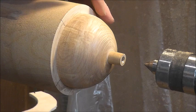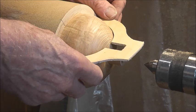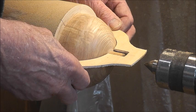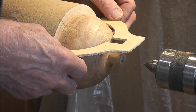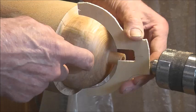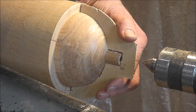I've taken it down by eye into a relatively nice curve, and I've got my template here. By putting these legs against here I can see I have to use my parting tool and bring this back a little farther there. Other than that, the curve looks nice. You want to have that perfectly lined up when these legs touch that point there. There's a gap in here, so I'm taking this down here a little bit, because I want these legs to touch here as well as the curve to be perfect. I'll just continue working on that a little bit more.